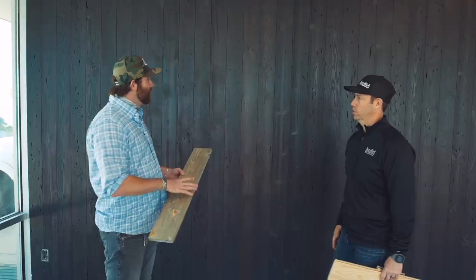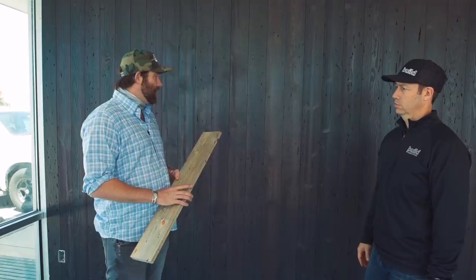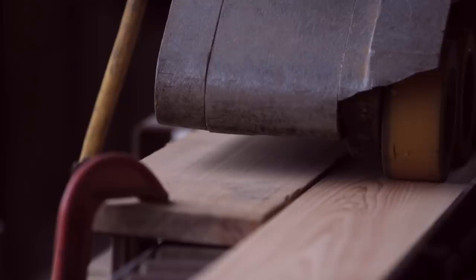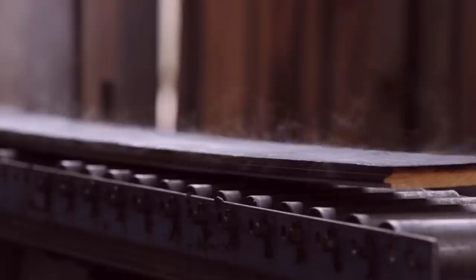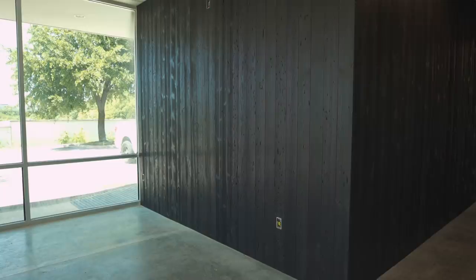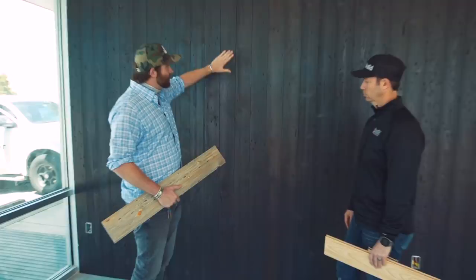It's gorgeous even in its raw state, but how do you go from this to that really inky black look on the walls? This is Shou Sugi Ban — we've been doing it for about 12 years. It's a char process where the wood is actually burned with fire, a Japanese tradition of preserving wood and making it fire resistant. We've taken that process and really modernized it, doing it on various wood species to different levels and different texturing techniques. With this particular product, we did a light char and also brushed it — that's where you see the grain really pop. There's no alligatoring like you get with a heavy char; we went with a more durable finish that won't flake, especially for a commercial office setting where people will come into contact with it.